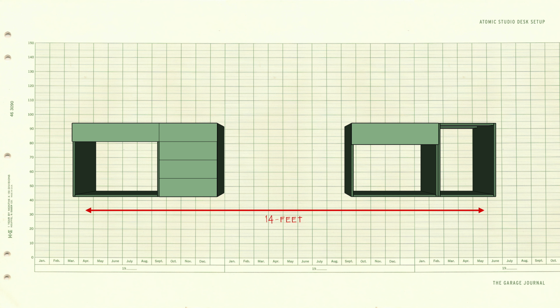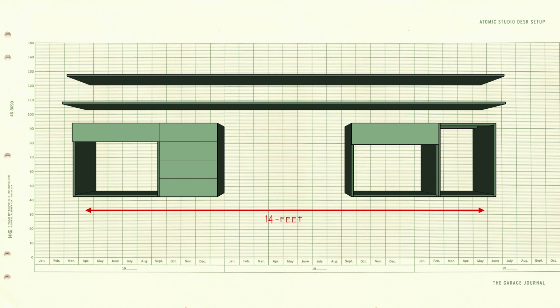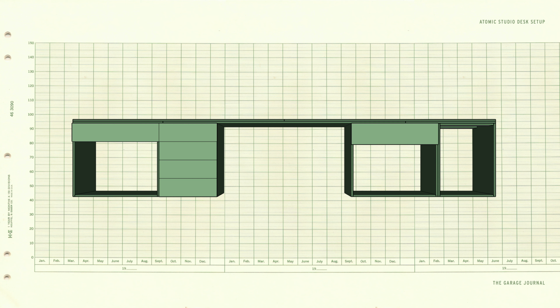I decided to make this out of 2 layers of Baltic birch ply, and because the longest sheet of birch you can get is 8 foot, I was going to have joints in each layer. My idea was to stagger each of these joints and then laminate the 2 layers to reinforce them. That's the idea anyway, so let's get started.